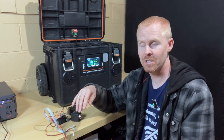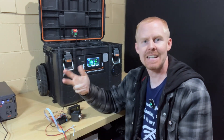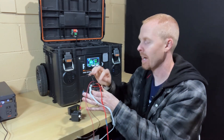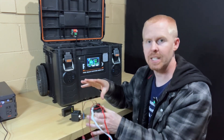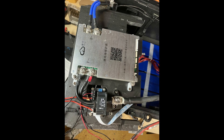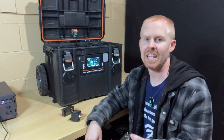I turned off all the protection features and it was still closing at random times. I could not find any pattern to why it would just randomly turn off. I had thought maybe it was because of how I had wired the power supply for the coulomb meter and the relay, so I went in and rewired it to supply dedicated power to the relay — and it still wasn't working. I followed every step in the manual, and the manual is significantly lacking.